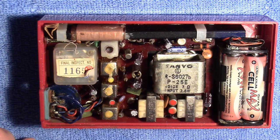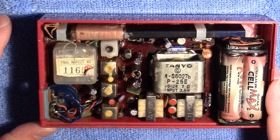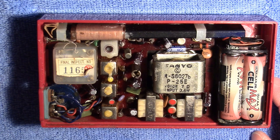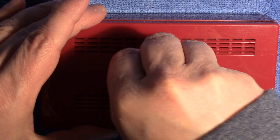But nonetheless, I believe it's ready to ride again. Maybe the caps weren't totally necessary — it may have worked. But how well would it have worked? Those caps were pretty bad. They were supposed to be 30 microfarad, and some of those caps were having a hard time getting to even one microfarad. So probably not a bad idea to have changed them anyway. I was already in there doing it. I'm just glad I found that little antenna wire and figured out where it went to get this thing to come to life.